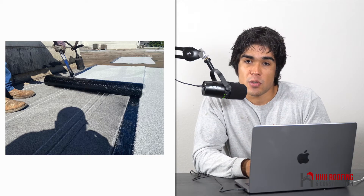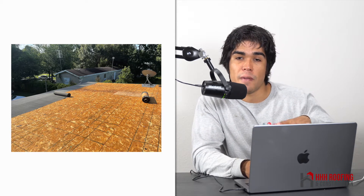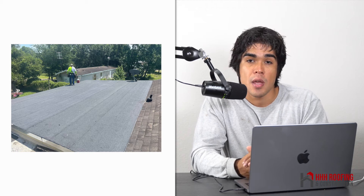If you're the homeowner and you have an area that's very low pitched or almost flat, install a flat roof system like modified torch. Flat roof systems are meant to hold water, so if you have water there for long periods of time, it is not going to cause damage to the plywood. It's an easy, quick solution, but you'd be surprised how many times I see homeowners with this issue.